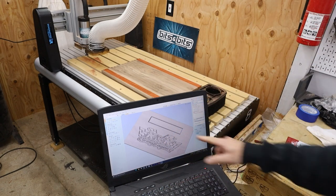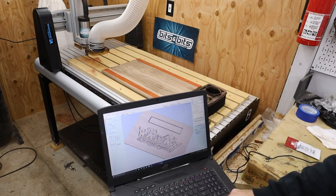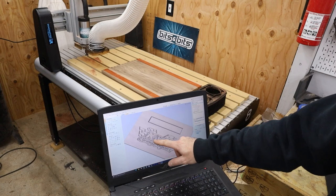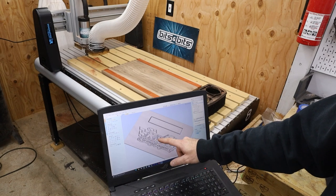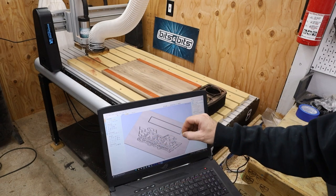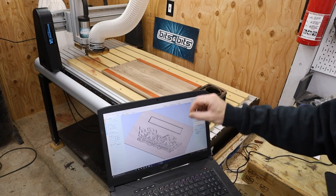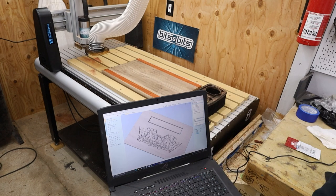So this is the logo I've got here — this will be a cutout where it goes over the steering wheel, and then his logo is here. We'll cut this first with a quarter inch down cut, and then use three bits on this part: quarter inch down, eighth inch down, and then a 60 degree V bit. I'm going to put you guys on time lapse. Probably won't see a whole lot because I'll have the dust boot on, but once it gets to the V bit I'll take it off so you can see a little better. Let's get to carving this thing out.